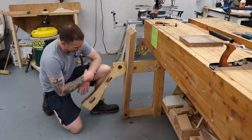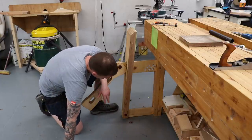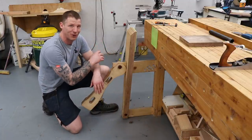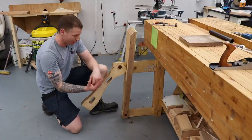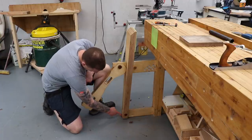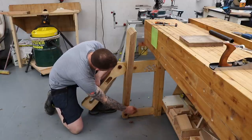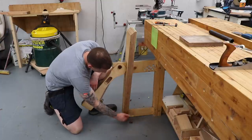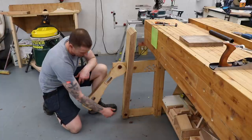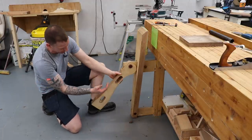Here's a quick look at what we've done to the vise. We've added a second tenon bar and an extra pivot point. I've mortised this into the bottom of the leg so it's able to pivot on that point the same way as the top pivot point. Both tenon arms are fixed together — this one is slightly forward — so our floor wedge is gone. We don't need it anymore because this is acting as the floor wedge now, moving in tandem with our top tenon arm to always keep the leg vise at the correct angle for good clamping force.